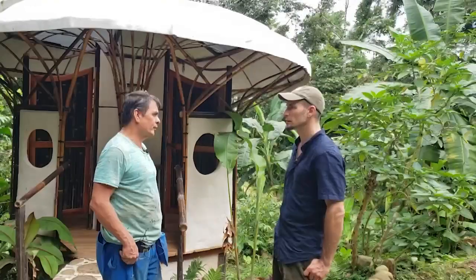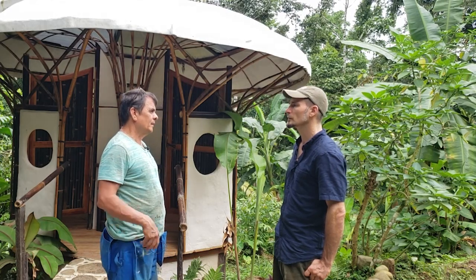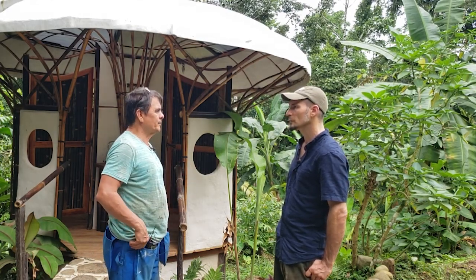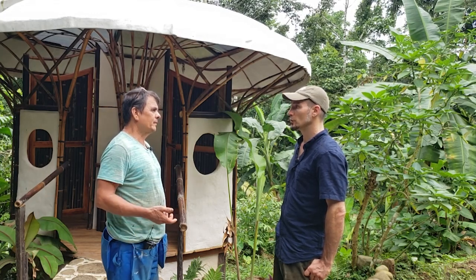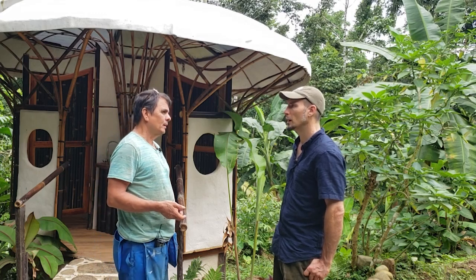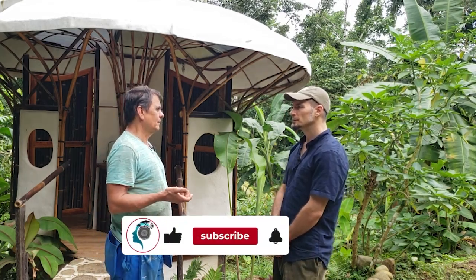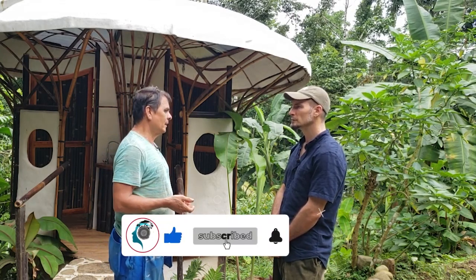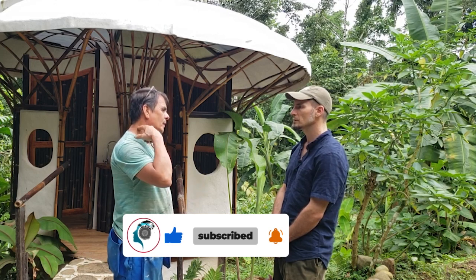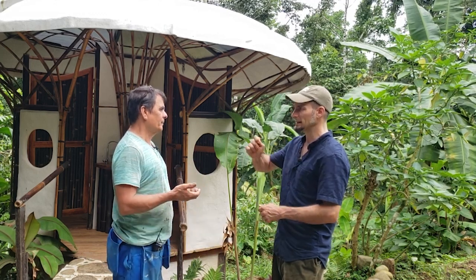I learned from the Chinese to put lime, sand and soil in the same proportion, and so you can save the wood for more than 200 years in the ground. Lime is used as a treatment for any wood that you put in the ground. Lime is a natural product, and lime breathes like clay. I use this in the foundation of the wood, so the wood can breathe in the ground.